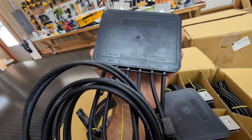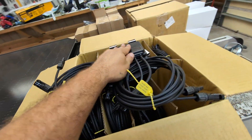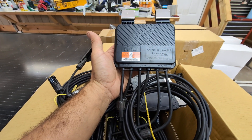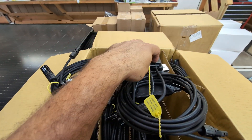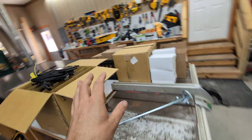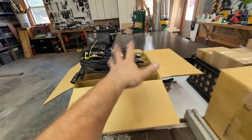All of the documentation about this device nowhere describes what's happening to the two panels as they interface with it — are they being paralleled or put into series? I spent about 45 minutes in technical documentation and finally found it on a third-party website. This device takes two panels and puts them in series. So if you connect it in series, it will continue that behavior. For a fully paralleled system, you'd have to use individual units and not the 2F.